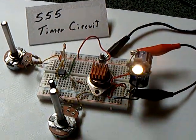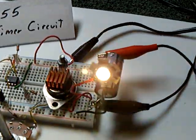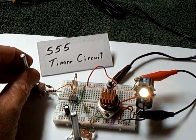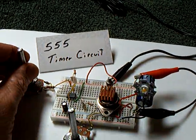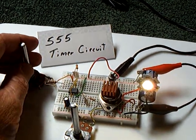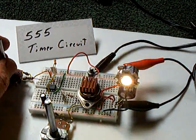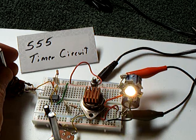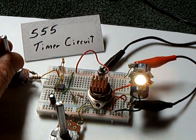I've been working with a 555 timer circuit, blinking them. This happens to be the warm white color, which I like, and I've been looking at the amount of power they require versus how fast you blink them. This little oscillator will blink this between a few hertz on up to about 200 hertz, and I wanted to see what the power was versus the amount of light I was getting out of it. Very interesting — I haven't made any decisions on that yet.